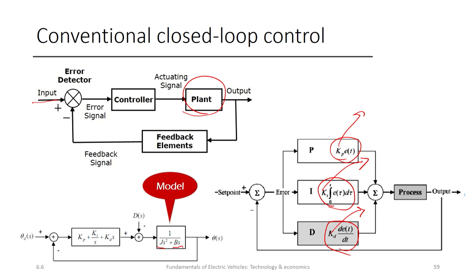I can do a number of experiments using different combinations of Kp, Ki, and Kd to see which one works — this is called PID tuning. Alternatively I can solve analytically, which assumes I know the value of J, B, and most importantly disturbances D — forces from crosswinds, road bumps, etc. It is not possible to perfectly model everything, but to the extent we understand it we can come to an optimum Kp, Ki, Kd combination. The job of these terms is: because we do not understand the physical model perfectly, there will be a deviation, and whenever there is a deviation, course-correct it.